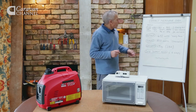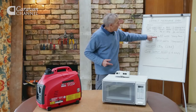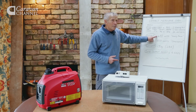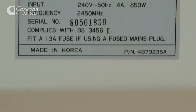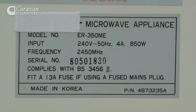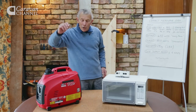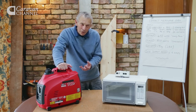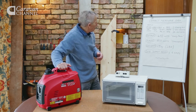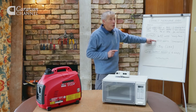Then there's the case of the input — that confuses people. They think that's all you've got to provide in the supply, but no: double that, take off about 10 percent, and you get a figure somewhere around here. That's actually on a label on the back of this — the input — and that's the current it will need to consume in order to operate. Now, how does that affect things if you run a generator? Well, this particular generator has a 900-watt output, and you might say 'oh, way over the 450 watts,' but no — this input figure is what you're looking at, and it's only just over that.